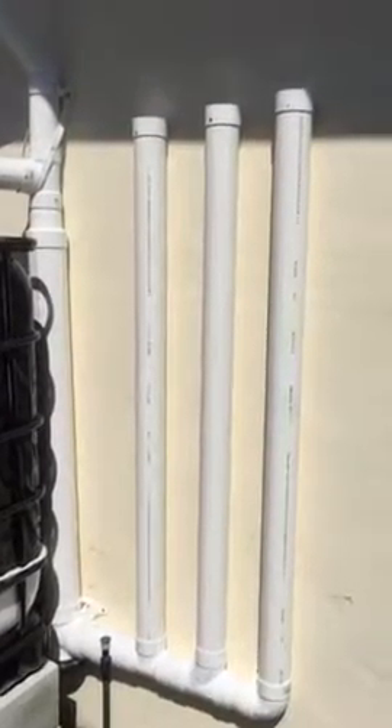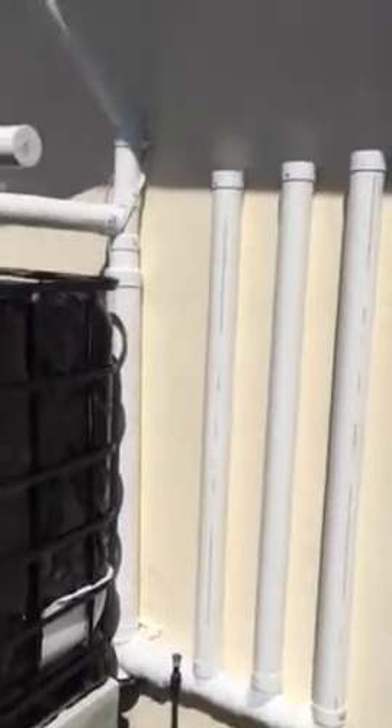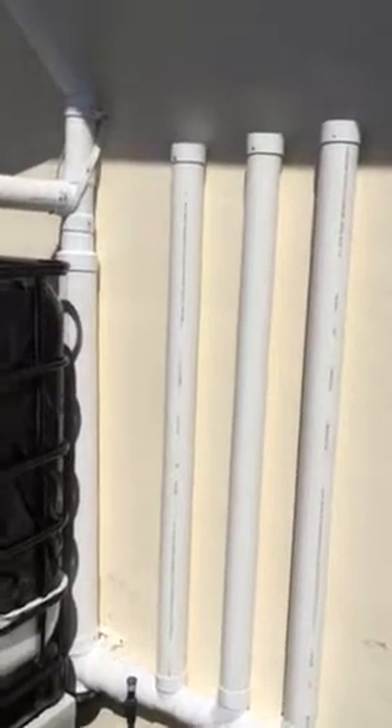So I'll just give you a quick rundown. If you have a three-inch pipe — which is what I have here — these are three-inch pipe, that one is a four-inch pipe. Three-inch pipe, three feet long, there's a calculation of 0.0125. So for every 1,000 square feet of roof, you calculate — you multiply it by 0.0125 if you're using a three-inch tube. If you're using a four-inch pipe, then that number changes to 0.050, if I remember correctly. I'll post it in the YouTube description. But anyway, there's a calculation.